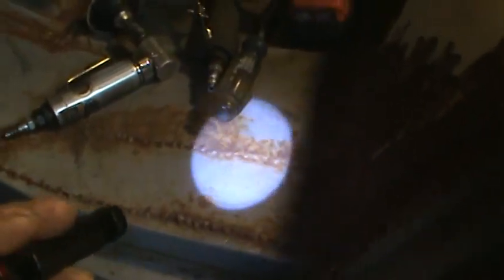And the other thing is too, is this guy. All the other ones are solid welded, pretty much all the way around the seams, except for this patch right here, which was stitch welded, but it never got back. Never went back and kind of filled them all in. The only problem is there's so much rust in between this, I don't know if I can get all that crap kind of cleaned out of there to get a decent weld.